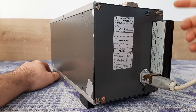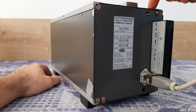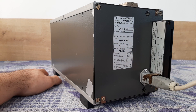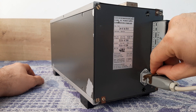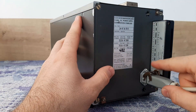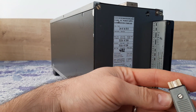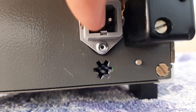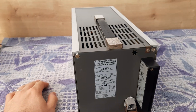Behind this plastic protection is the main circuit board, and this main circuit board is longer than the box and casing — it comes out like you see. Here you have the grounding points for the upper and lower covers. The mains cable makes a fast but very nicely secured connection. You have to lift this metal plate and then you can take out the socket. It's made in Germany and I found this socket on TME in Poland — I was planning to use this kind of socket on another project.